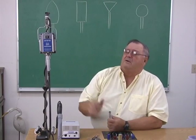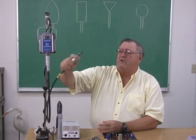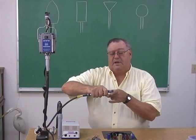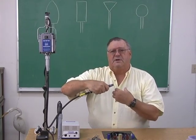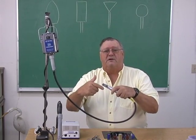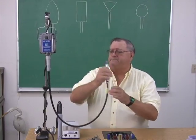The SR, what that stands for is the S is the model of the machine, the R means that it can be reversed. Now, the reverse, for the most part, is more applicable to left-handed carvers. By the nature of the beast, this machine, when it's running forward, has to be cutting so that the cut is on the bottom and it's coming toward your face. That's the nature of the beast. If you're left-handed and you move it this way, it'll be running opposite for left-handers unless you put it in reverse. And because of that, it'll be running away from you all the time.